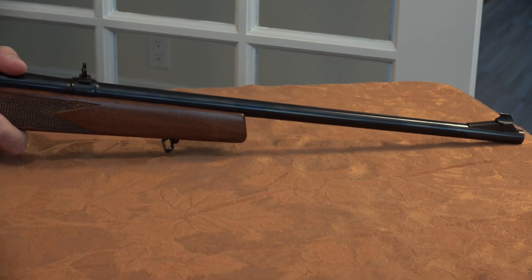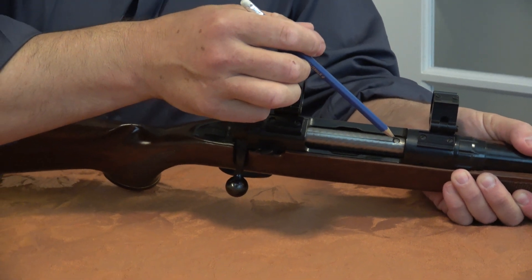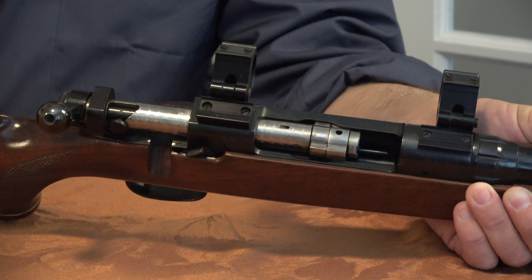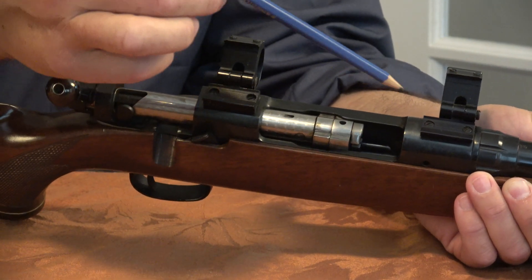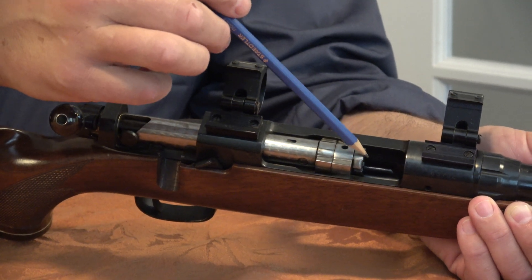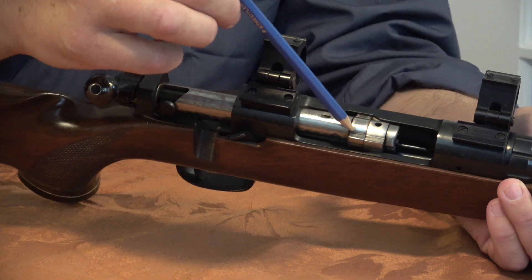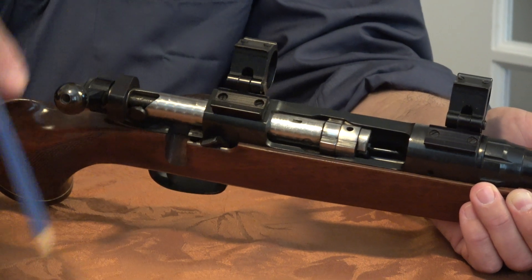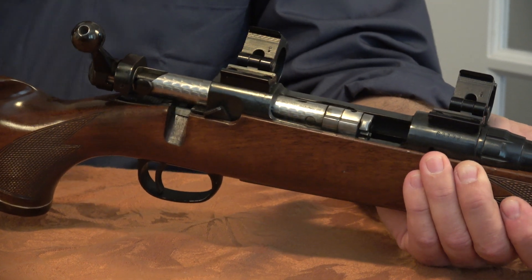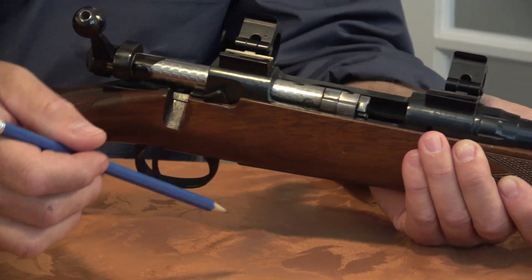As I rotate the bolt, you'll see a pin appear. If you remove the bolt and drive out that pin, you can remove the entire bolt head assembly. Many modern rifles now offer takedown barrels. If you change from .30-06 or .270 to a Magnum cartridge, the bolt face has to be changed. By driving out that pin, one can theoretically remove the lugs, bolt guide, and bolt head. Newer rifles from Sauer and others use a removable bolt head almost identically with that pin — a concept also carried on in the Blaser R8 and R93.